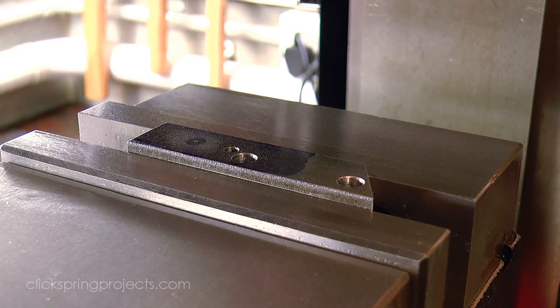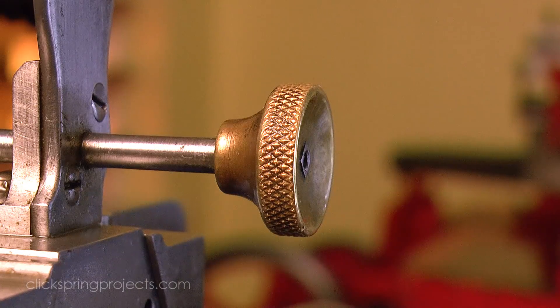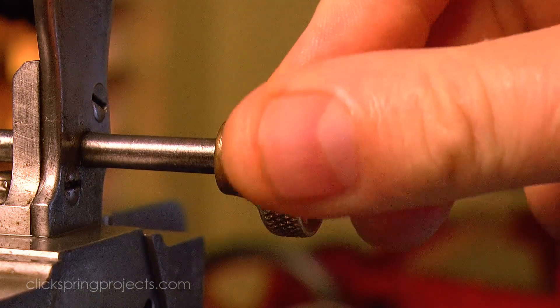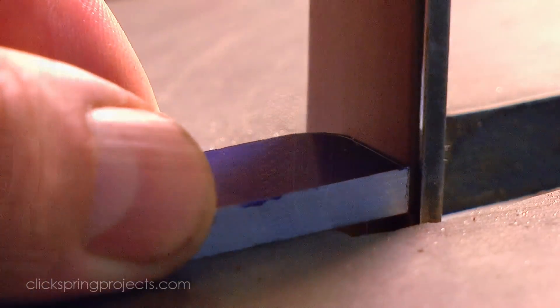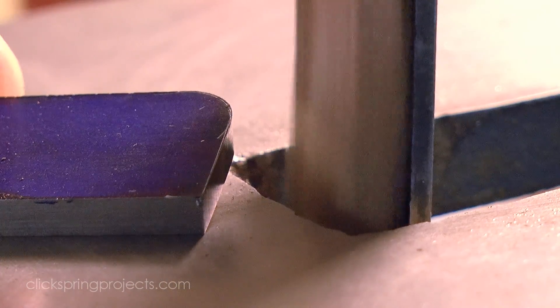For the thread pitch and overall design, I'm following the existing guide adjustment screw for precedent. The brass fitting has a fine knurled finish with slightly worn and soft edges, a sort of bell profile, and a concave face. And I'd like the thumb wheel on the stop to sit comfortably alongside that, so time for a quick custom form tool to make that profile.